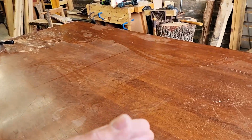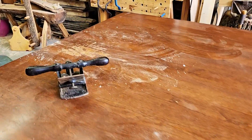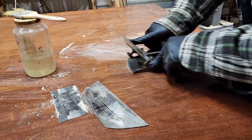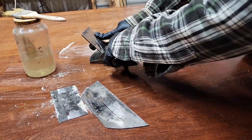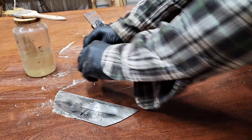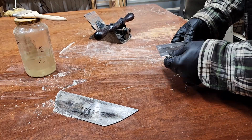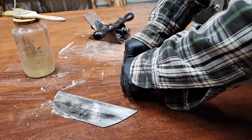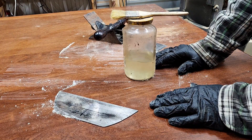All the aprons are on, angle iron supported in there, everything's good to go. I flipped it over and I'm going to start stripping it. After using the veneer scraper and some of the smaller scrapers, this stuff is coming off, but I think the better option — I didn't want to do this — is to go ahead and chemically strip it.